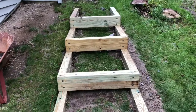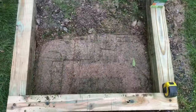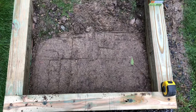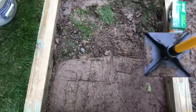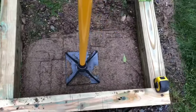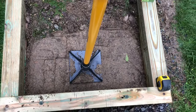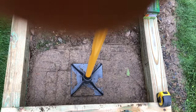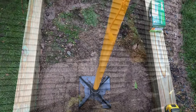Today we'll address drainage and continue working on the stairs. I took some fill sand and used my 8-by-8-inch tamper to pack sand into the bottom — just one bucket load for now — but that will allow any future rain to drain right through and make its way out to the yard without filling up pools in the stairs.